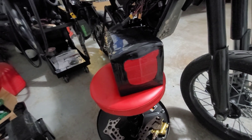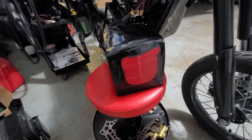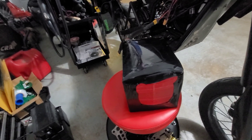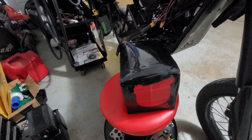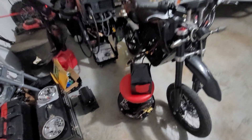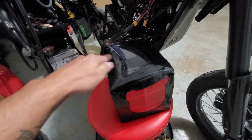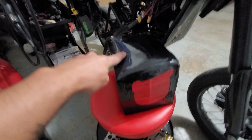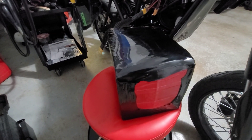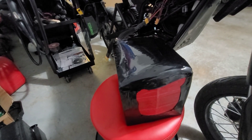A couple of reasons I did this swap: one, I really wanted to learn — this is a great first step. Another reason is the ANT BMS was getting super hot and it was leaving me stranded every once in a while. I found out that the temperature leads were right next to it, so when the BMS was getting hot it was cutting out even when the cells weren't that hot themselves.